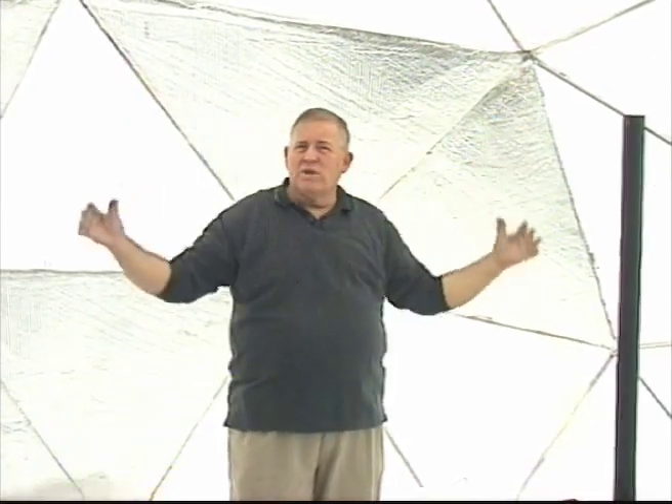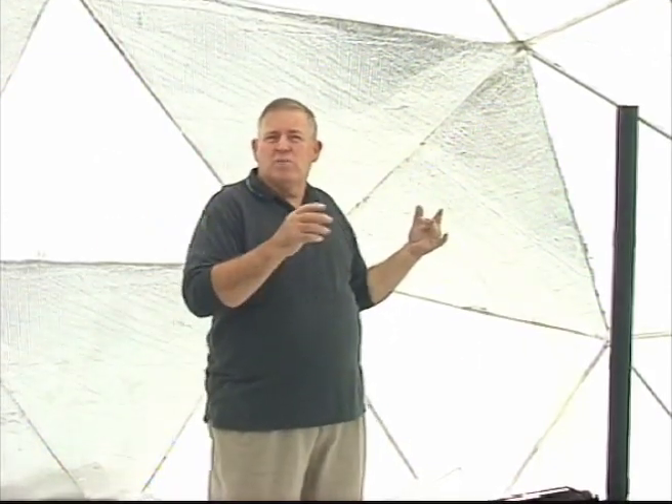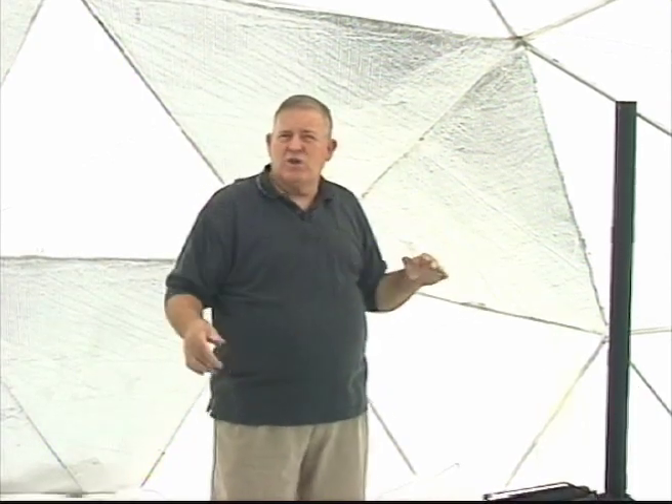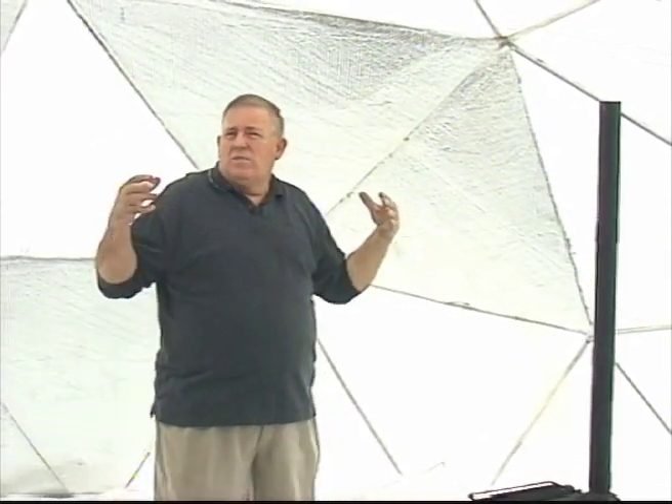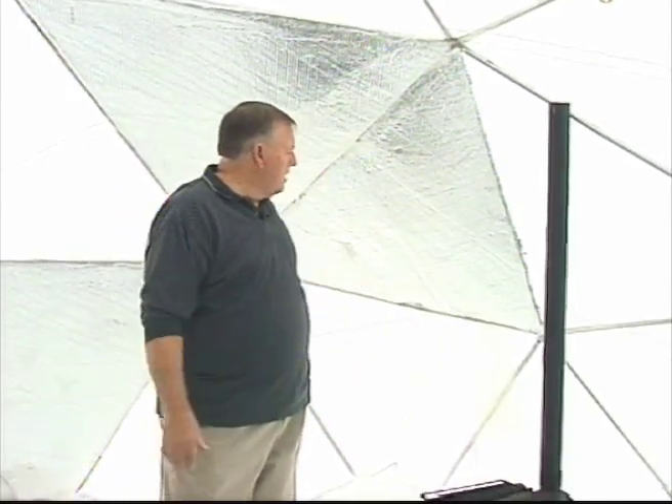It's very quick to set the frame up. Once the frame is set up, you can go ahead and put the insulation on it, then put the cover material over the top. The cover is pulled underneath the bottom of the frame, pulled tight, and you make pleats wherever convenient. You cut off the excess material, and we provide 45 four-inch-long clips that snap right over the bars at the bottom, with a small set screw that goes in quickly — holding the entire cover as one integral piece of the dome structure. As I mentioned, it's withstood very strong winds; we've observed 70-mile-an-hour-plus without the cover coming loose at all. Then the floor is put in, pulled tight, and snapped with additional snaps to hold it tight and wrinkle-free against the frame.